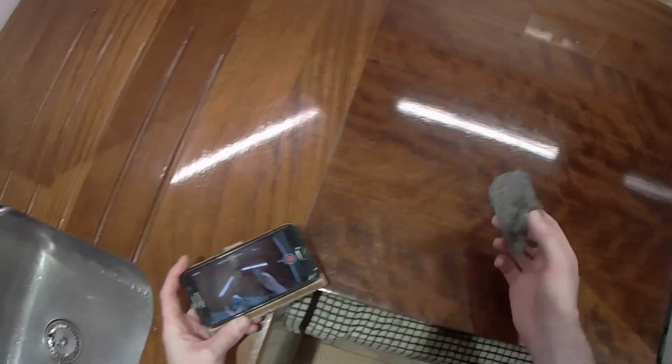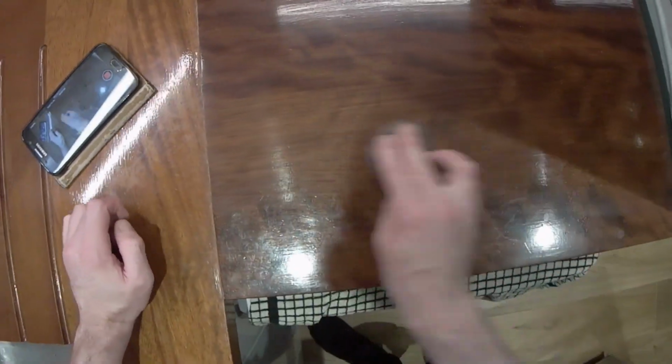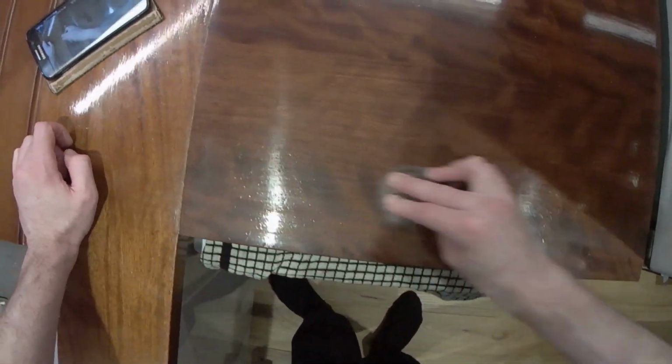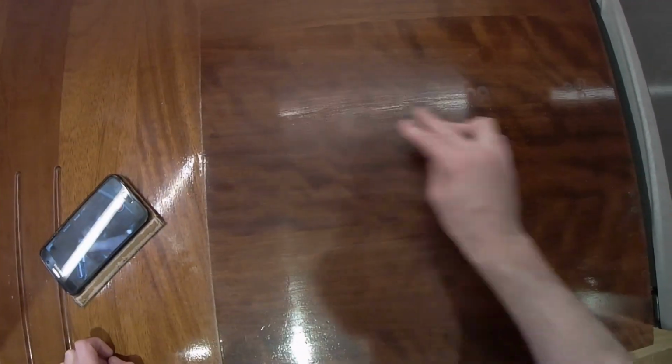So what we'll do is I'm going to use steel wool, and I'm just going to rub this all over and take this top layer of oil off, and all the wee scratches and things will come off, they'll disappear. Again, it's not 100%, this is a wood worktop. Over time it's going to develop scratches and knocks that you can't sand out with this method. And that's okay, it's character. That's just the nature of this kind of surface.